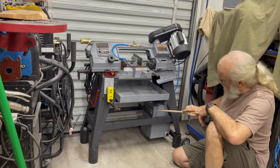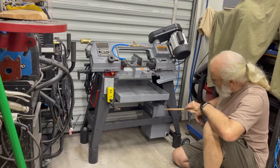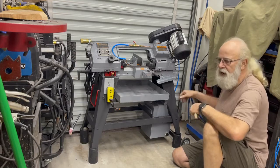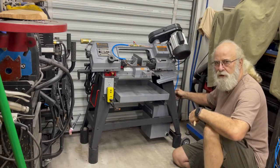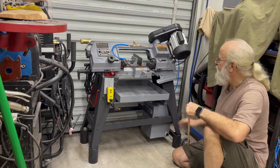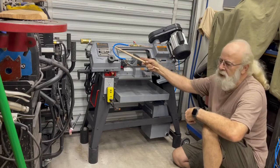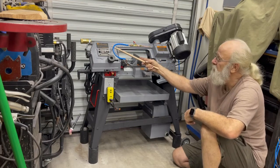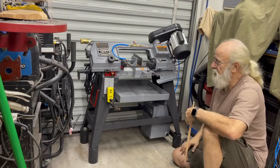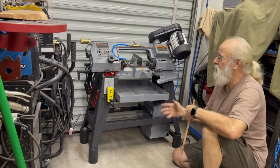And I built this tank, 8-inch by 8-inch by 12-inch square. There's a panel in the center, like to divide it. And there's an $18 tile saw pump from Home Depot for a Ryobi tile saw. And then, of course, the rest is copper. And this is 8mm OD, 5mm ID, PVC plastic airline. And it's oil resistant, solvent resistant, all of that.